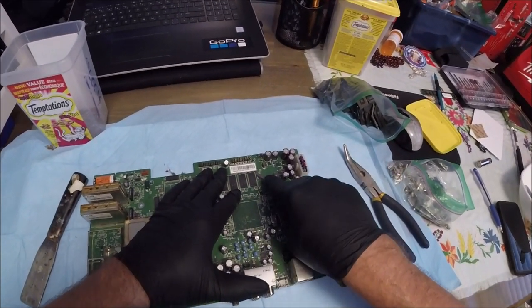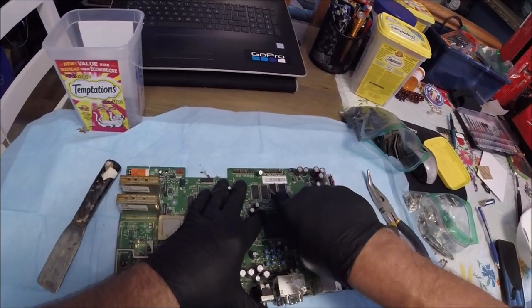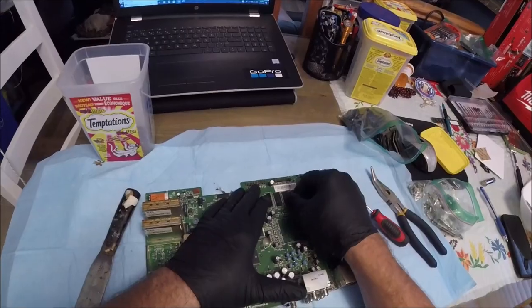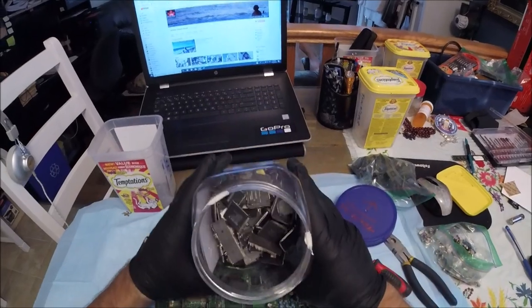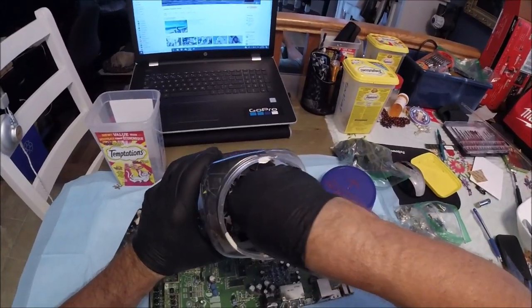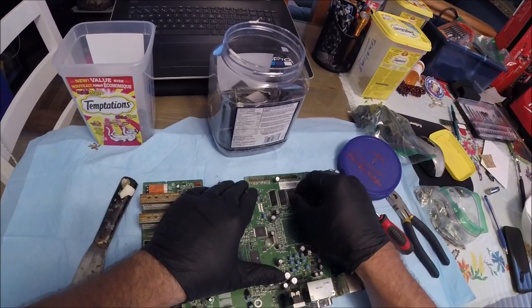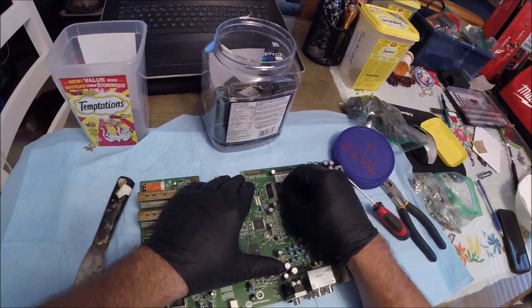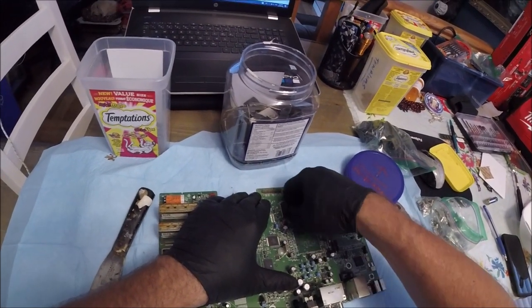These are gold corner chips — they're high yield, usually a lot of gold bonding wires in these type of chips. As you've seen in my other videos, you just square one side like that. I'm putting the better chips in one bag, not the crap chips, because a lot of IC chips won't have anything. These type of chips are a more likely possibility of having gold bonding wires. I'll take off all the MLCCs, crystal oscillators and different things.